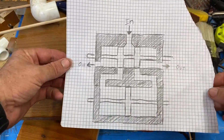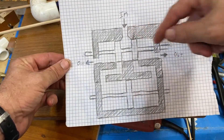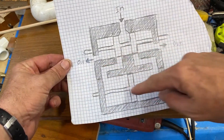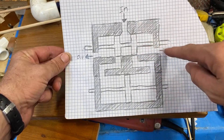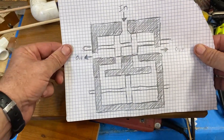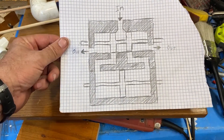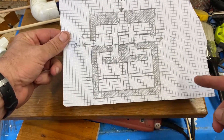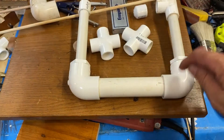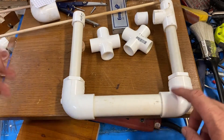Here's a diagram of how it should work in theory. Air comes in and it's directed by a slide valve to one side or the other of the cylinder chamber. While it's letting air in one way, it's letting exhaust out one of the other two ways, so it goes back and forth. The output will be connected to a flywheel and a camshaft to time it, but all the air cylinder stuff will be made out of PVC pipes.